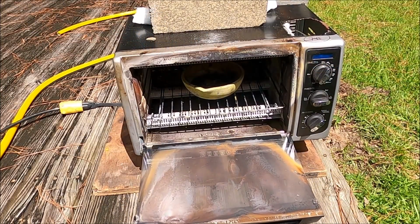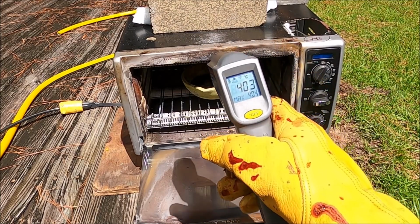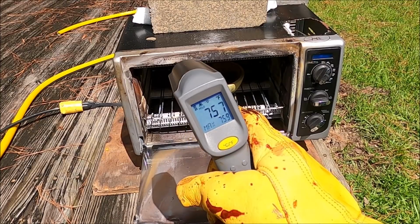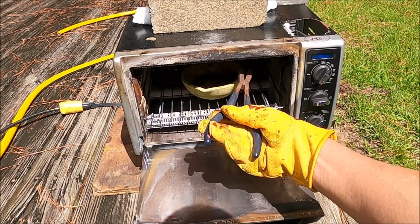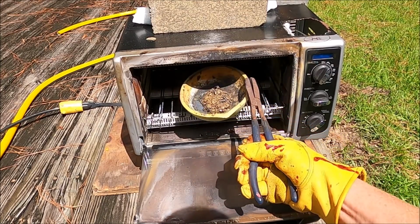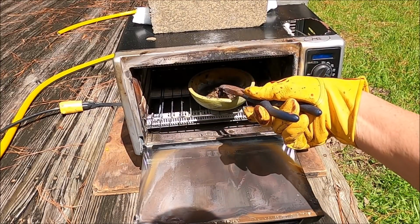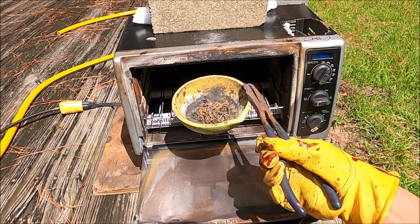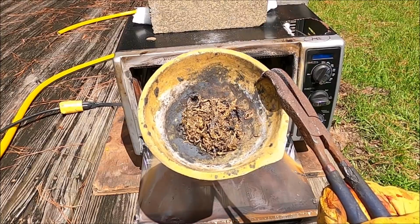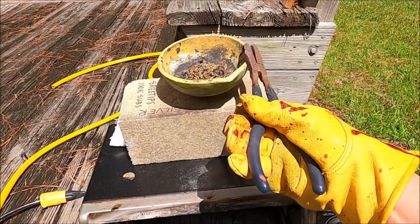Okay, let's turn our attention back to the gold foils. They've been in that oven now for about an hour and a half. You see 403 Celsius, 757 Fahrenheit. So that should be enough there to have boiled off any combustible material that was in with the gold foils. They're nice and dry, nice and loose, just like we want them. So we can go to the next step, which is dissolve it in aqua regia.